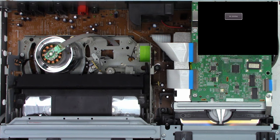Okay, back on the bottom of the mechanism. Remember, the fine machine thread screw goes on the right-hand side. That also does provide a ground connection to the chassis, electrically, I should say. And then the coarse thread screw that looks like that goes underneath the ribbon cable. Once again, being extremely careful to only apply as much torque as absolutely necessary on that ribbon cable.